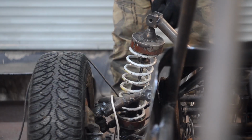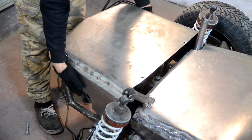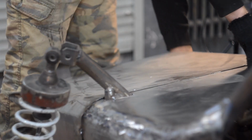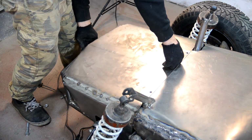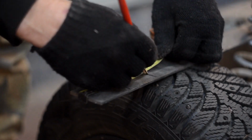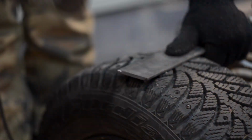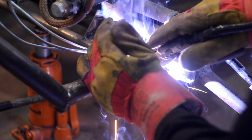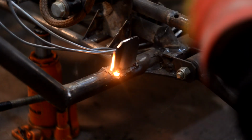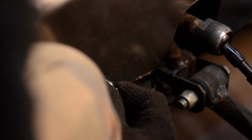I put away the racks so they didn't interfere with welding operations and adjustment of the forward casing. We need to make 2 more fastenings for it on each side. For this purpose I cut off 2 details from a slab and welded them to the frame so they were hidden behind the casing. I drilled the casing with a slab and pulled it together with a bolt.